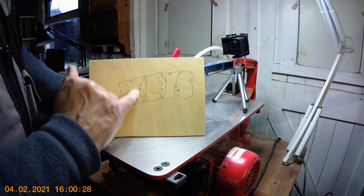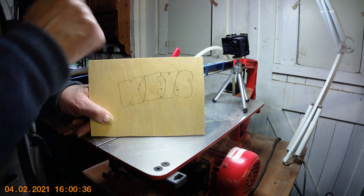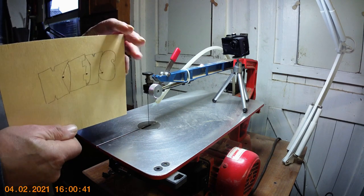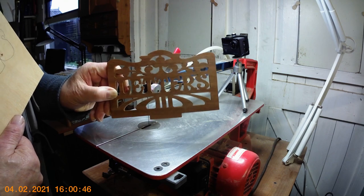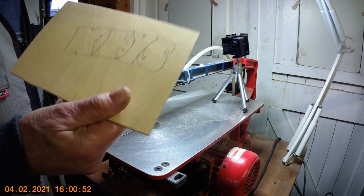If you're doing just three or four cutouts it's not so important, but if you're doing something with quite a lot of cutouts, you'd soon get fed up constantly changing the blade. So here's how easy it is: release the lever to release the tension, undo the quick clamp, poke the work through the hole underneath, pop it back in there, tighten up the quick clamp, and you're good to go.